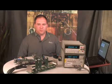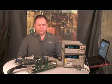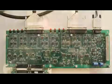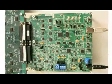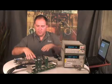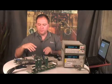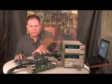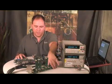The PGA308 is really a room temperature version of the PGA309. The system you can see before you starts with the master board, which is a multiplexer. It connects to the USB DAC platform, a board that generates the digital and control signals that control the multiplexer board. The USB DAC platform is connected to the PC, which runs the calibration software. This board over here is a sensor interface board, and this is where your sensor modules and pressure sensors would connect. This board could go into an oven for temperature calibration.